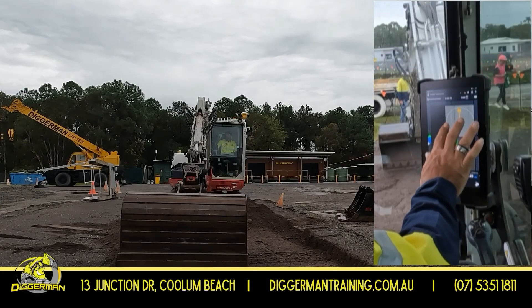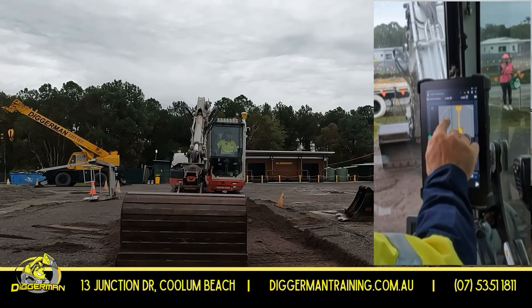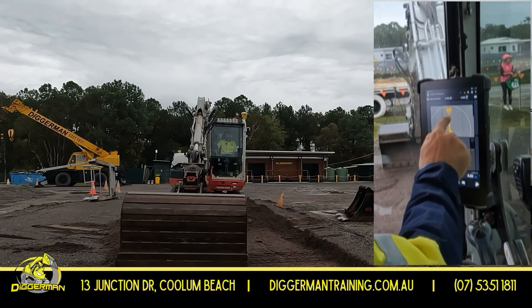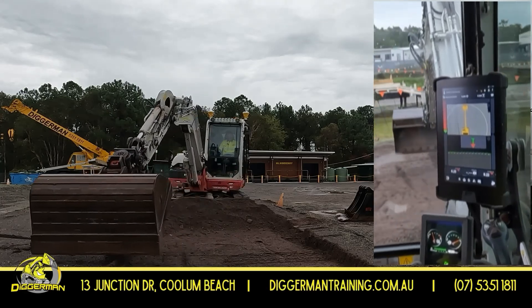This is our design up here. We've got a little bit of curb set up — so that's our curb on this side, our centre line there, and our curb on the other side. Two and a half percent to our centre line, and then two and a half percent back down to our curb on the other side.